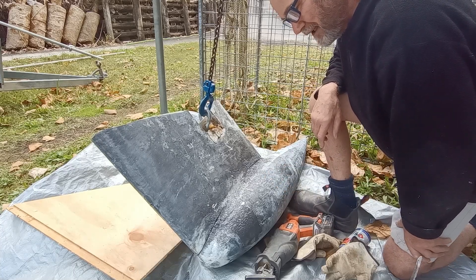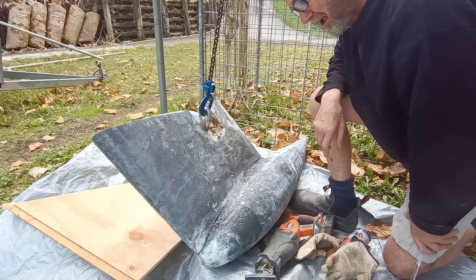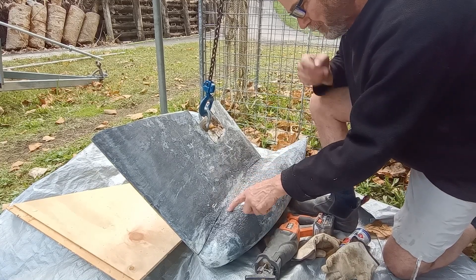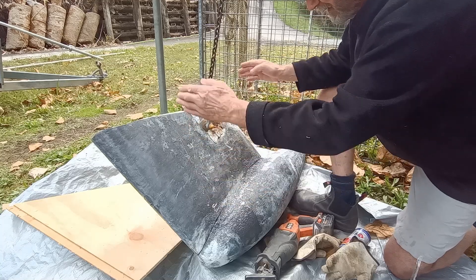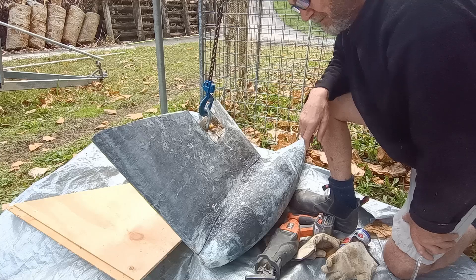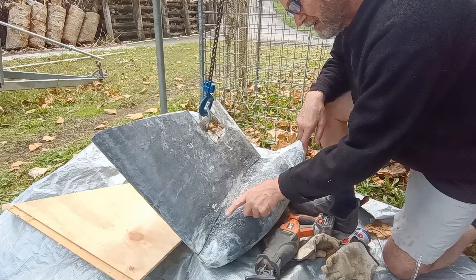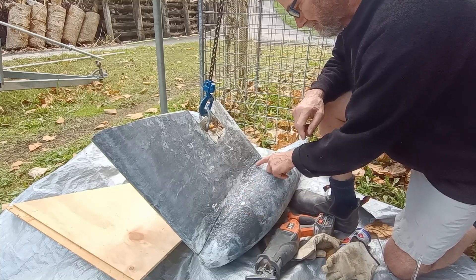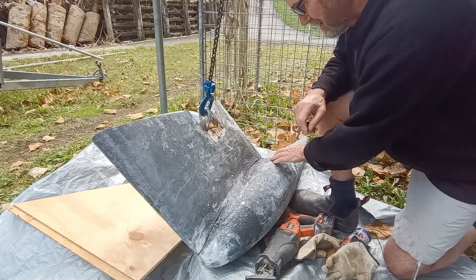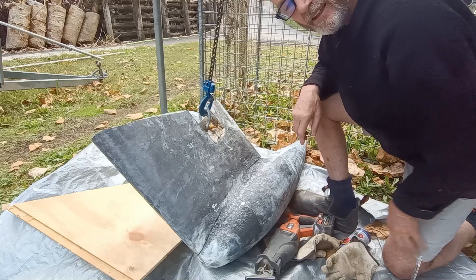So it's got me thinking, and I came up with a possible solution. What was going to be the top of the bulb, with the dagger board coming down here bolted through — what I've decided to do is cut this off, trim it up with a grinder where the stainless is, and make this the bottom of the bulb and route out the other side, so the bottom becomes the top.